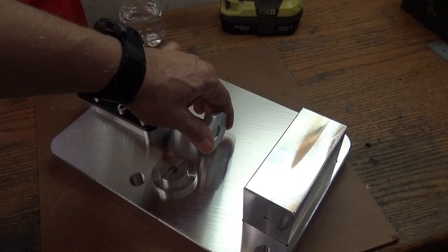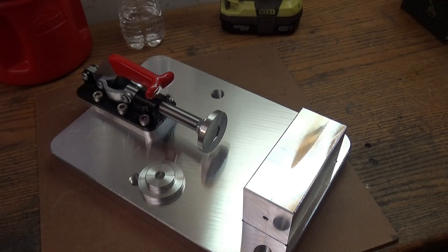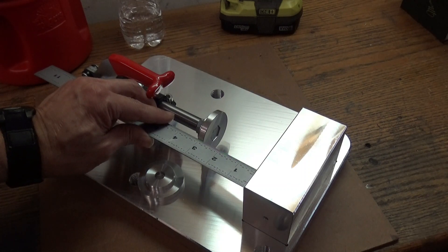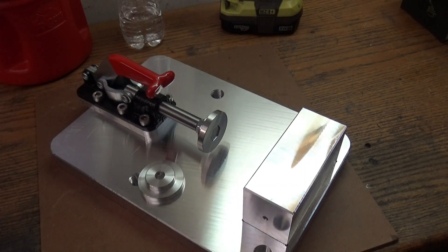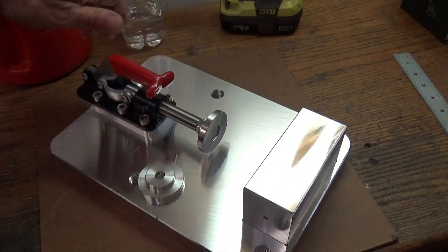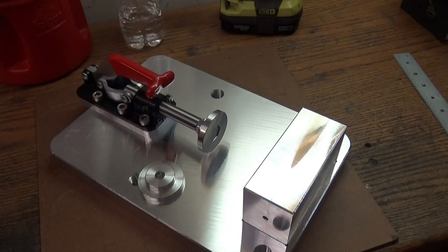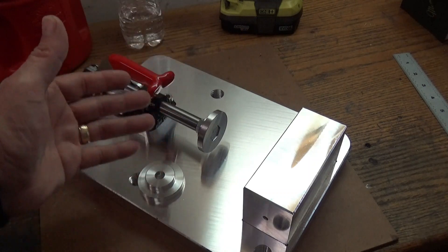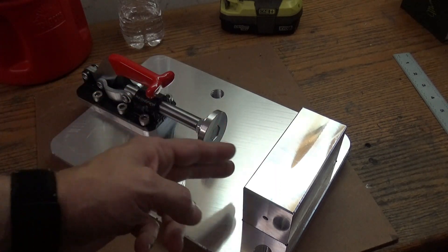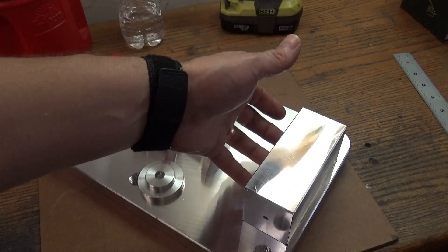Alright guys, there you have it — turned out really well. Fits nicely. And that's going to leave us with a couple of inches — when this is fully locked, that leaves us 2 and 13 sixteenths or so for a mold. In the original design, Charlie had this adjustable with a couple of screws so you could push this out and get it nice and tight, because there's no adjustment on this clamp. I was hoping to get away with just making some shims to keep my mold standard size — an eighth inch shim, quarter inch shim, whatever to get it to lock. We'll see if that works out; if not, we'll remachine this with some adjustments.